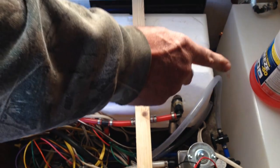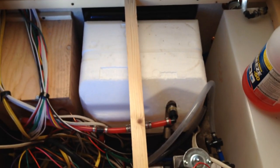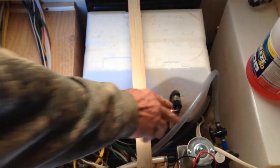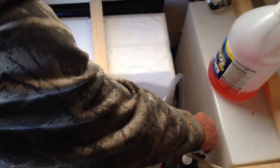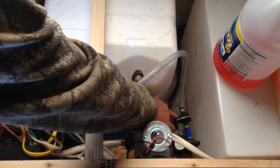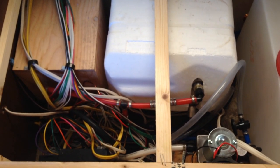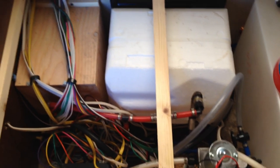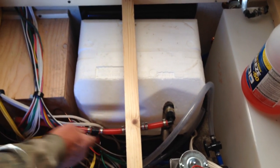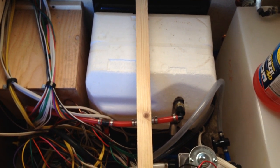So what you're going to do is fill that maybe half full, and then close the water tank. And then open the bottom valve and close this valve here. Then turn on your pump and flush the whole system out. And then once you flush your whole system out, go ahead and open these valves here and close this one. And then as long as you have your plug in outside, you can fill up your hot water tank.